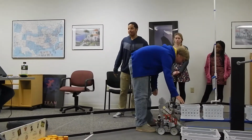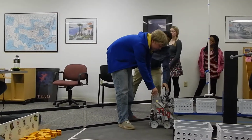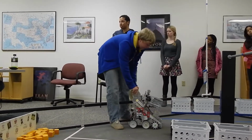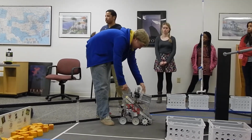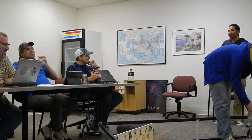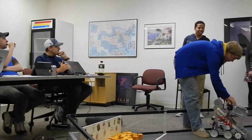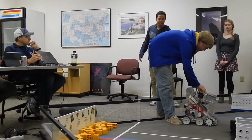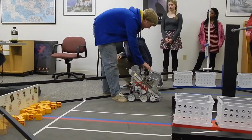After we score the IR beacon, we're going to add code to have the arm raise and bring this servo arm back in so it's out of the arm's way whenever we're scoring cubes. The arm is going to come back down, but the side rollers are already out, so we're ready to start scoring for Tele-Op. But that wasn't it. We wanted to push the limits. So what if we could go backwards and go right in front of the cubes? What we added into the code was a touch sensor on the robot, which you'll see is right back here in this corner.